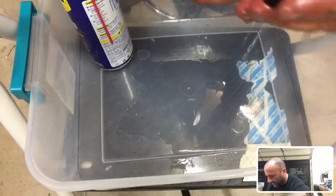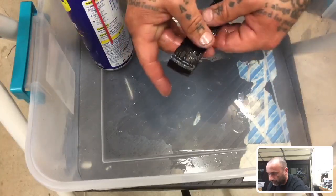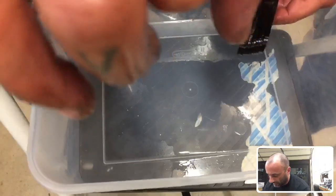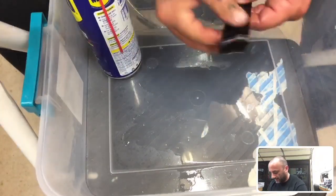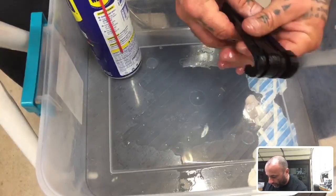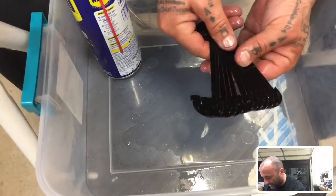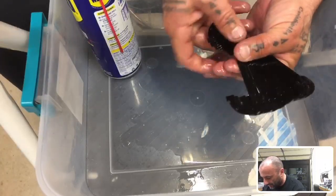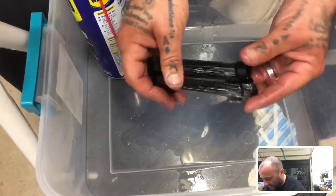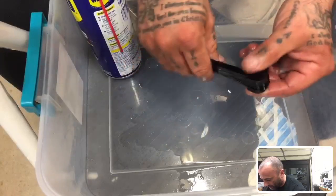Before carbon fiber became the thing, G10 was the choice for a lot of people, and the reason is because G10 is very strong, and it's comparable to carbon fiber in strength. However, it's not brittle, therefore it will flex a little bit more than carbon fiber, where carbon fiber will snap. The biggest thing about G10, and my biggest thing about it, is non-conductive. So I don't care if my board touches the frame. I don't care if the screw goes through the frame.